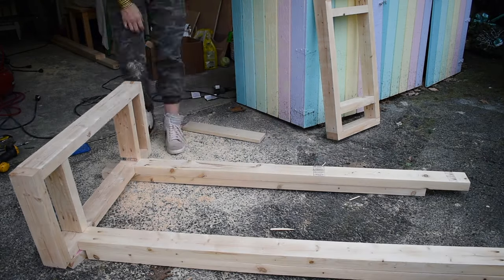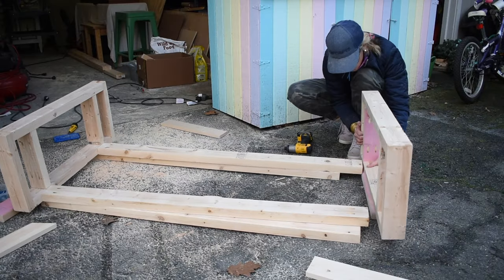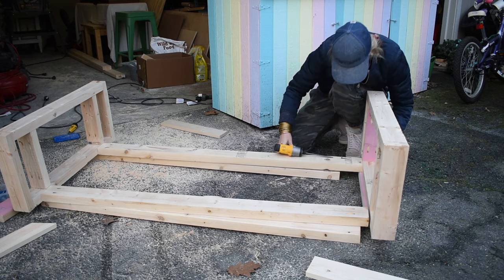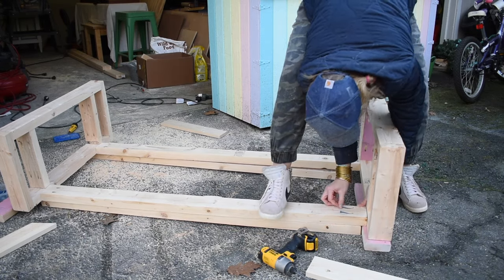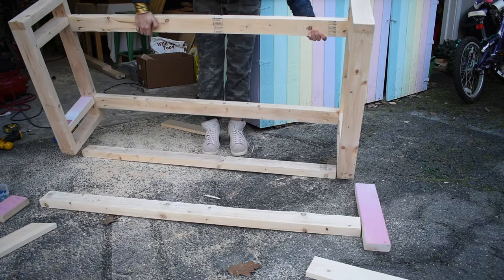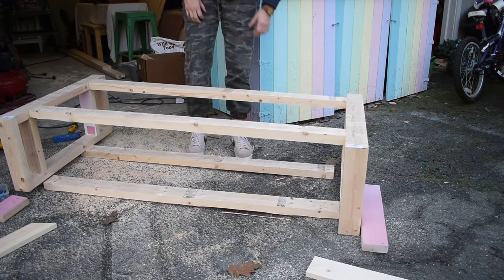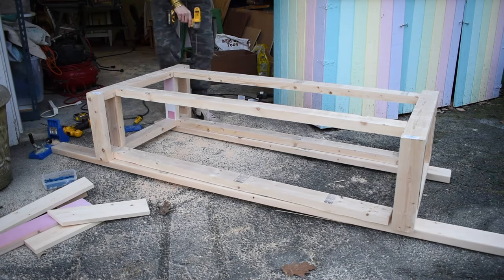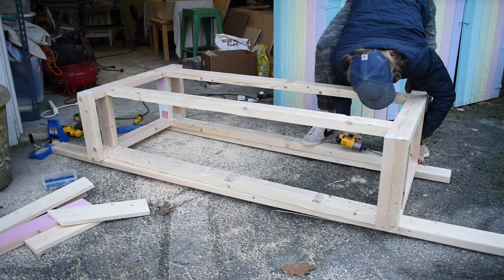The basic shape of the table is a square frame for either leg and then cross beams to connect them. I'm using pine for this build, which is not ideal for outdoor furniture, but it's so cost effective, and in my experience the pieces I've made have held up pretty well when stained or painted. For a bit more stability and also to give us a little more storage, I added a shelf across the bottom. I used some scrap lumber to line up the cross beams so I could secure them to either table leg using my pocket holes.